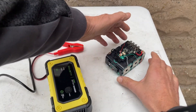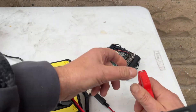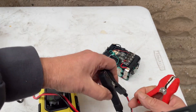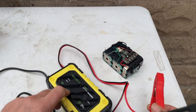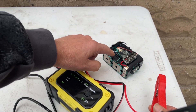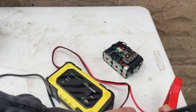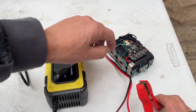I brought it outside because I had experience before taking a rechargeable battery apart and actually it did set on fire. This is supposed to be a 20-volt battery, but I'm going to try it with a car charger because right now, as I measured before, it's only measuring about one-point-something volts. I think it's just too low for the regular charger to work.